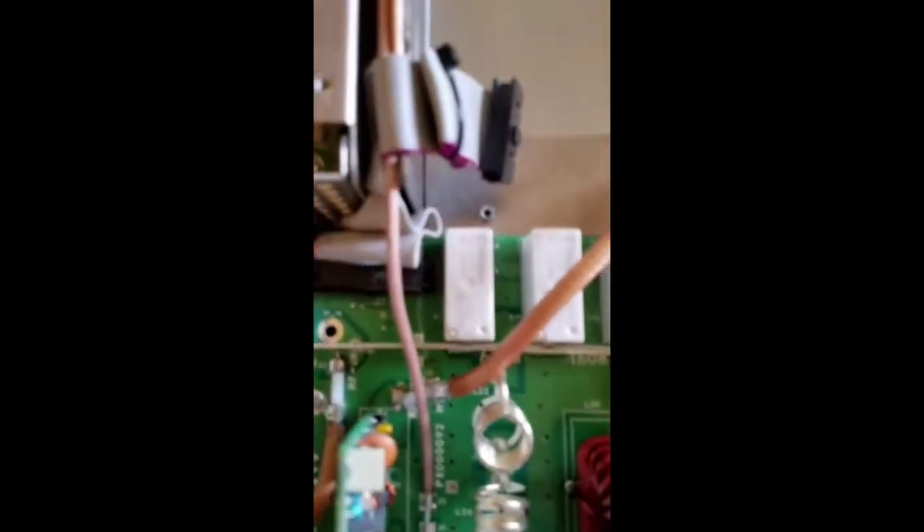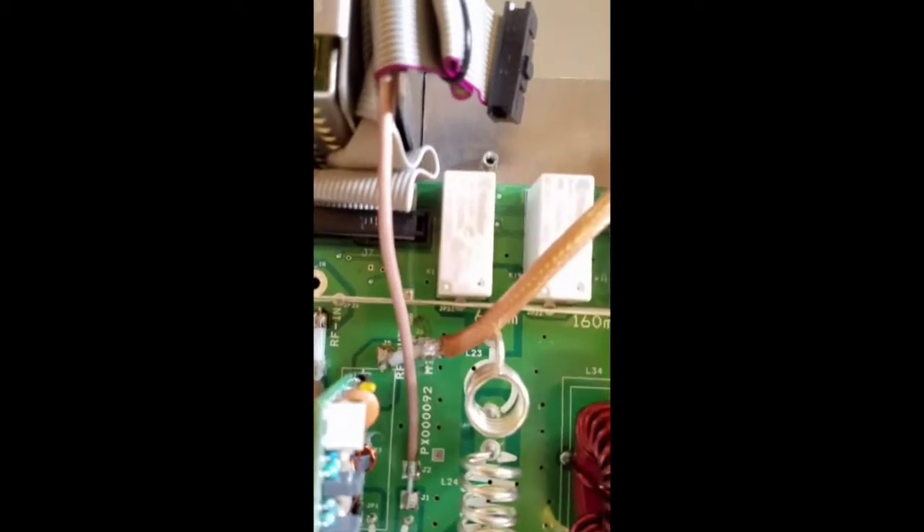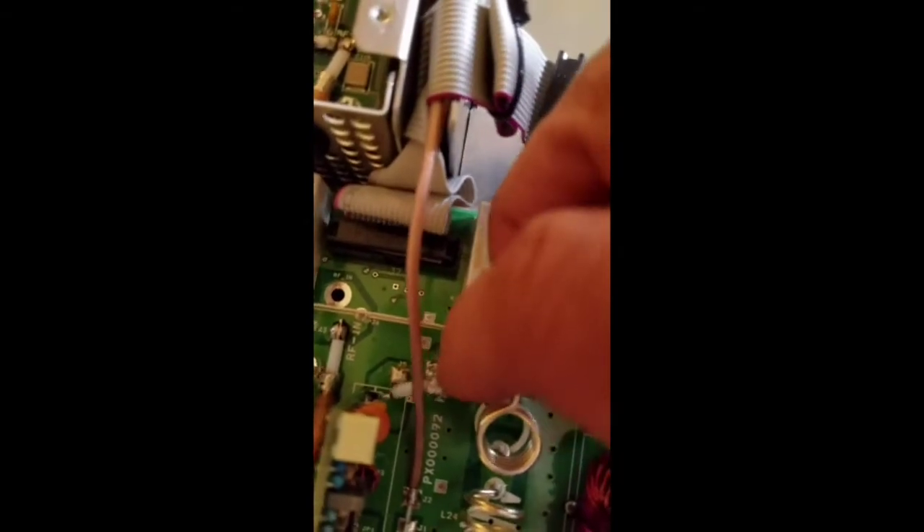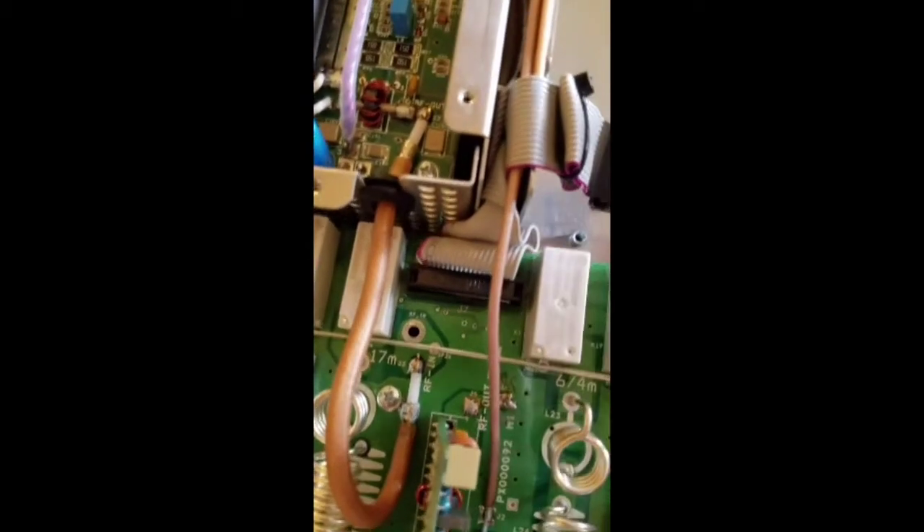The cable ends have been heated up to the point where they loosen. You need a fairly good soldering iron to do that — a soldering gun, just to get enough heat, because we're talking about the braid. It's high-quality coax with Teflon dielectric, so it can handle the heat. Once the cable is ready to be removed, just pull it out. Be careful — you've got to come around, go under, and then take it out.